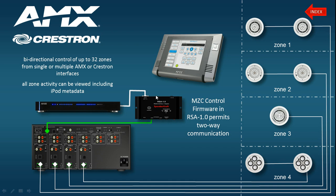This is a data-centric product, so it plugs into the data bus, also known as the expansion bus. It could plug into the loop or the port. Generally you would plug two MZCs in via the port, so usually the RSA1 would be plugged in via the loop. Please ensure the address is set to zero and that this is the first device in the loop.